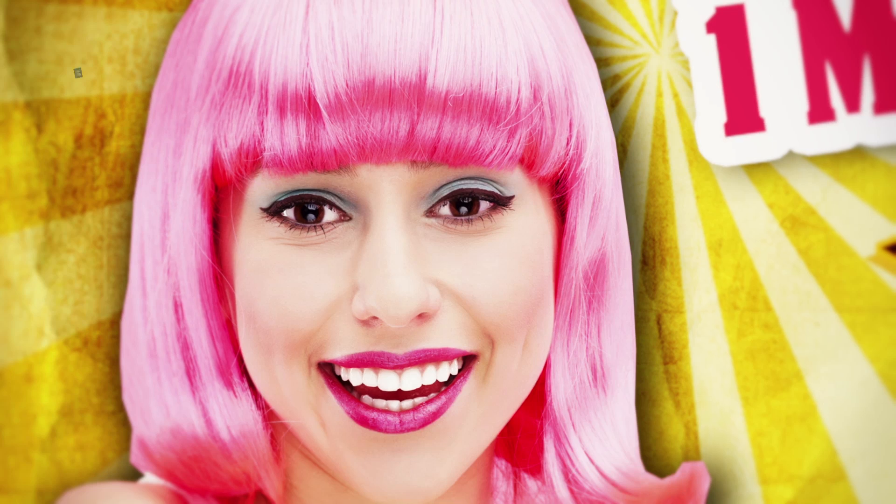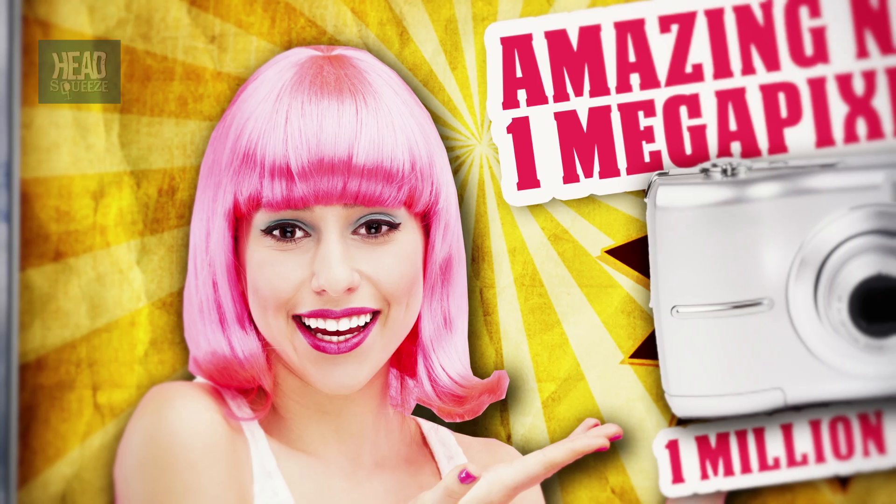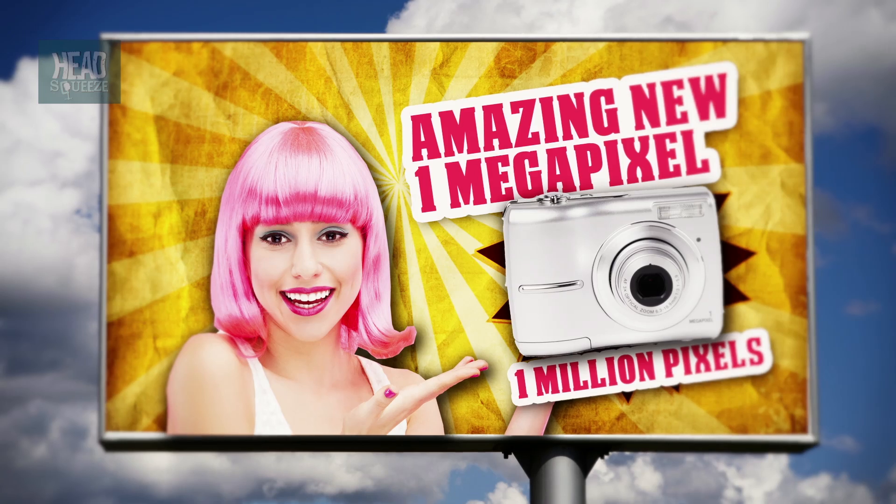The camera sensor is covered with tiny individual light-sensitive cells, each of which can measure the amount of light that falls on it. As the digital camera has evolved, so have the number of these pixels on the surface of the sensor. Ten years ago, you'd struggle to get a digital camera capable of delivering much more than a single megapixel of resolution — a million total pixels, or a grid 1,200 by 900. But these days, 12 or even 16 megapixels are commonplace among top-spec prosumer and professional cameras, enough to produce images the size of a magazine cover with no loss in perceived quality.